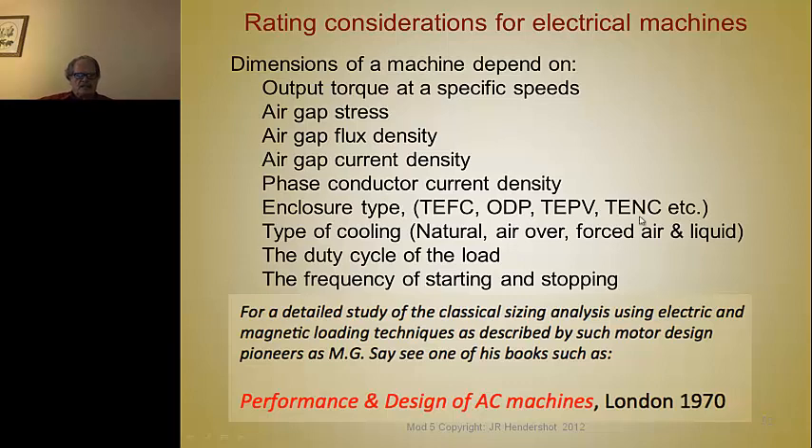What type of cooling is the motor going to be subjected to? Just natural convection — whatever air is moved by the temperature of the stator OD causing natural airflow by convection over the surface to take away the heat — all the way to forced liquid cooling and every possibility in between. The continuous rating of the machine depends solely on how it's cooled.